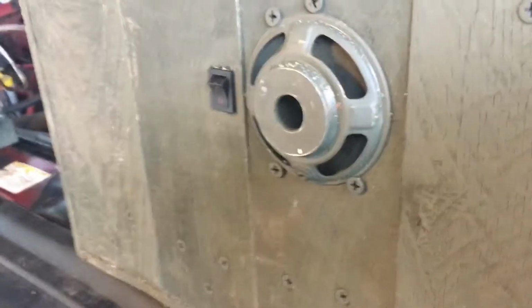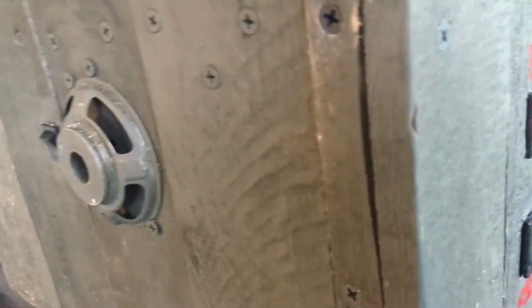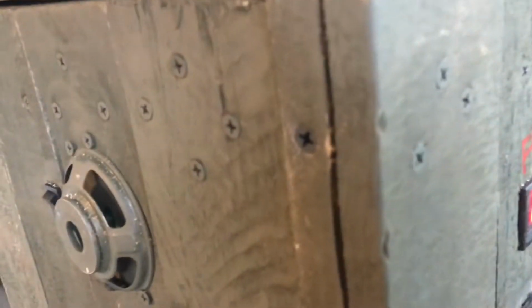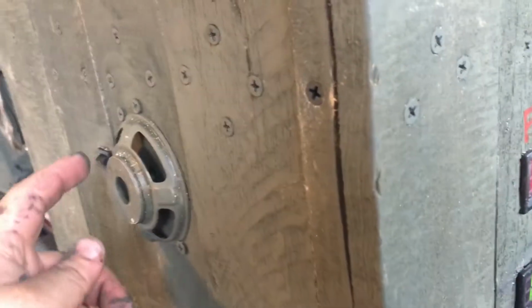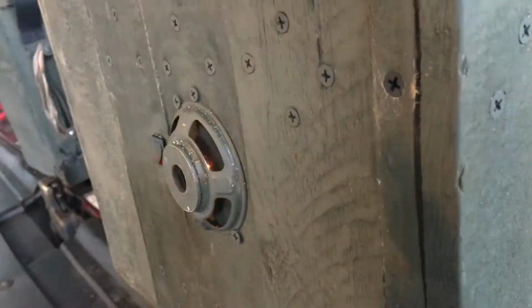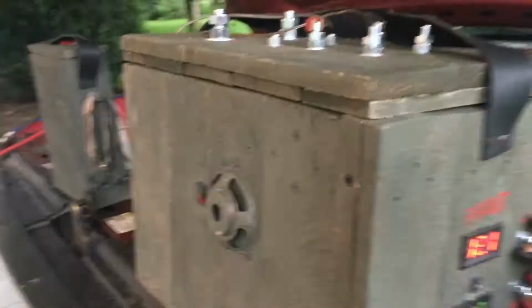So if I'm gonna jump a vehicle, that's kind of risky. Well, I got a contactor in here which I think is 20 amp, which would give me a total of 30 amp, but that has a coil that it has to run, and I did the math and it would kill that battery in about 13 days. So I have it separated, and I created a blinker, and there's even a little speaker in here that makes a tap at the light bulb to warn me.